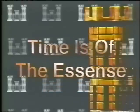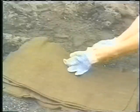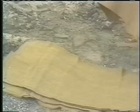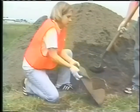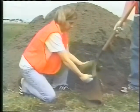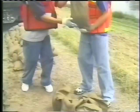Save yourself time and energy by following some basic rules while filling sandbags. Filling sandbags is normally a two- or three-person operation. Always wear gloves to protect your hands from the coarse filling material and the treated burlap bags. One team member should crouch with feet apart and arms extended and place the bottom of the empty bag on the ground. Hold the bag open and form a one-and-a-half-inch folded collar at the top. A second team member empties a fully-rounded shovel of material into the open end, filling the untied bag approximately two-thirds full. A third member stockpiles the stacks.